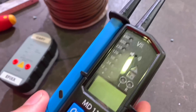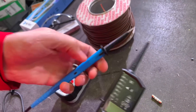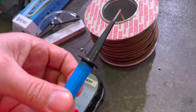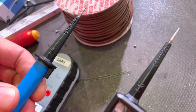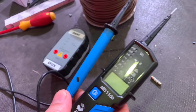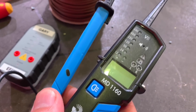So it's obviously two probes — one's fixed to the device itself and then you've got this wandering lead which is up to 1.2 meters, so if you've got big arms you can test a long way apart. All these things we're going to talk about sometimes come into something called GS38 — I'll put a link in the description below. It's a very useful document if you're testing electrical systems, and it's only about eight to ten pages long, so very readable.